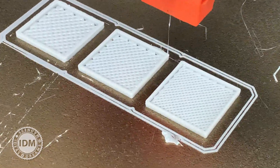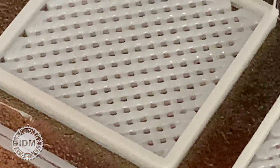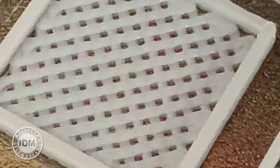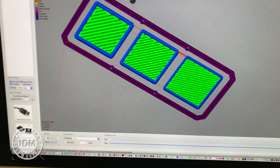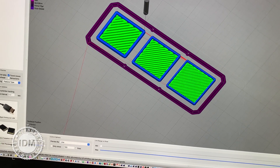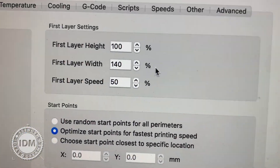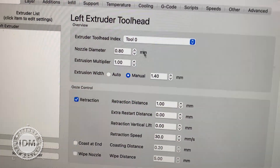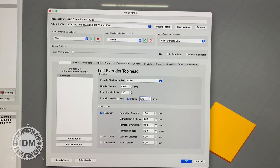Looking closely at those first bottom layer steps, you'd think you'd need to adjust it by around 200% — those gap sizes look relatively like square holes. Next I'm going to do a run where I relate the actual layer width to the extrusion width, just out of curiosity, to see what happens. I'm doing this because as you move to bigger nozzles, all kinds of other dynamics come into play.